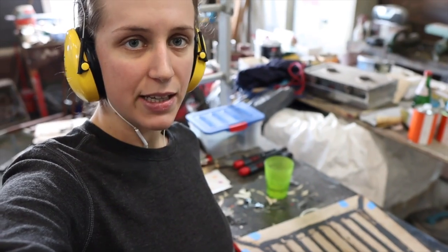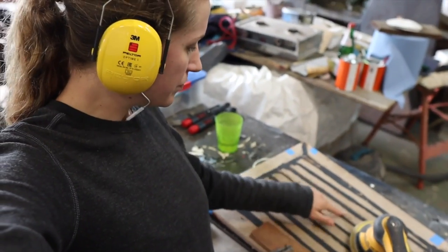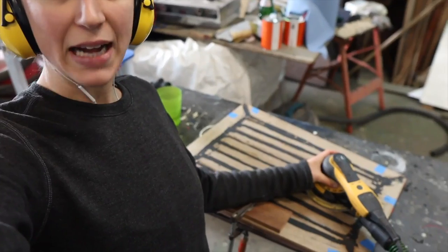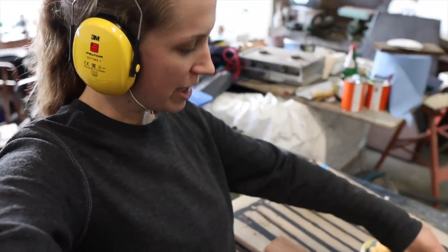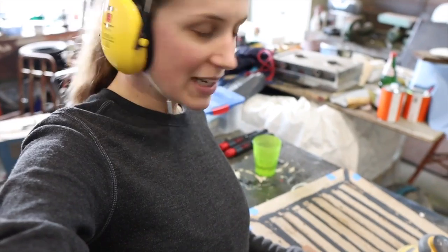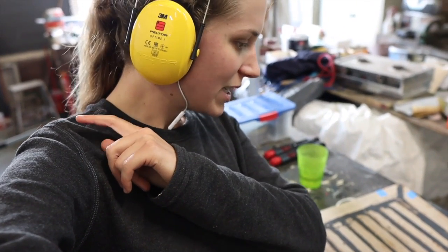Aladino recommended between 80 to 100-grit sandpaper, so that is on the harsher side, but I have to flatten it all down. The main key is to make sure to keep the sander really flat — almost never do you actually want to tilt the sander. You always want to make sure that it's flat. Aladino is working on the cabin top with a GoPro time-lapse, so I'm just going to get at it.